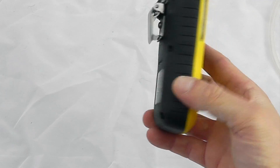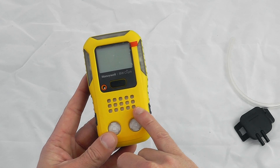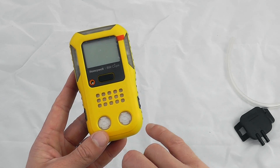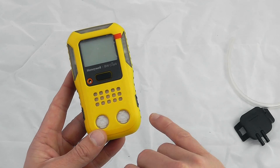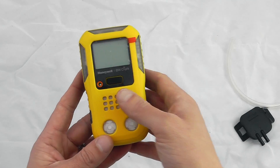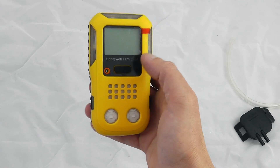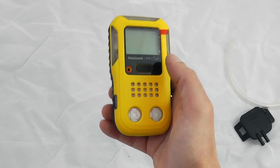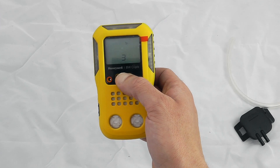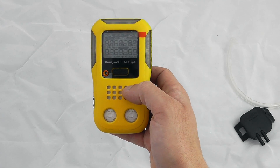Once the unit is in operation there's no charging. In the top section we have the infrared sensor; in the bottom section we have the O2, CO, and H2S sensor — a DuoTox CO/H2S sensor. We've got alarm lights around the top and a screen protector on the front. It's single-button operation — turn it on and it runs for the next two years. I'll hold the button down — three, two, one — and we have activated the instrument.